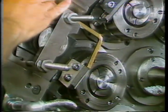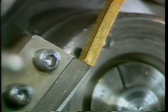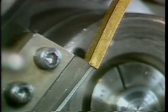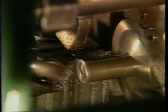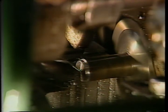The most common chatter problem is caused by forming tools being positioned below the centerline of the part. When the cutting tool is properly positioned, the cutting edge will be flush with the top of the centering gauge. Dull cutting tools are also a cause of chatter — when a tool becomes dull it will drag or bounce on the work.